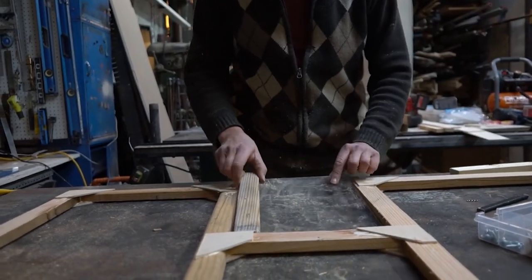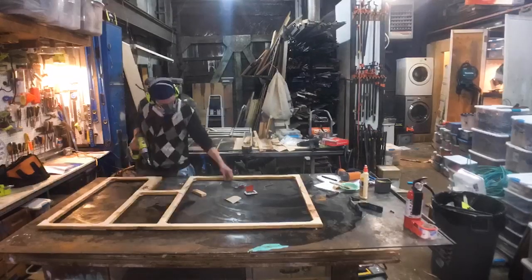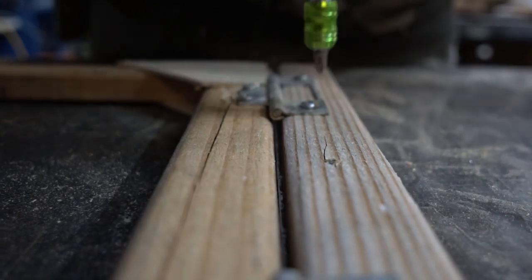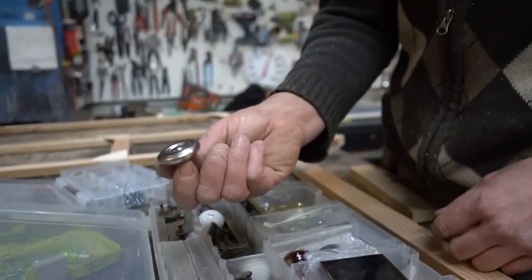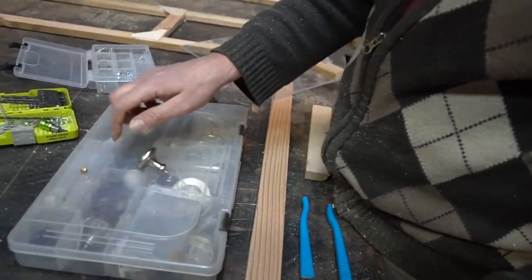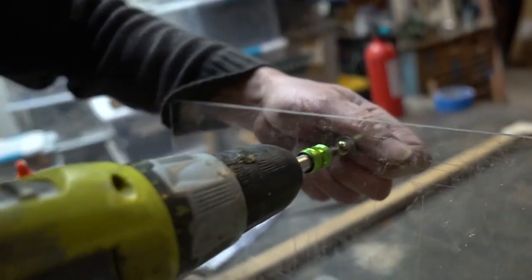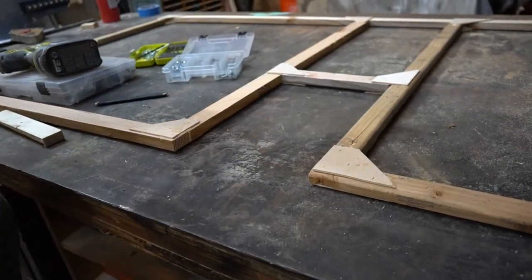Flip it over and get your hinges. When installing your hinges, the hinge pin, the round part of the hinge, should be facing up, and it's your spacer. It's the space between the piece of wood you just screwed to the plastic and the frame. The bolts that come with drawer pulls are not intended for such thin material, so you can buy number 8-32 half-inch bolts and washers, or cut the bolt that it comes with. Attach the knob and check the door. Then remove the door from the frame, keeping the hinges on it, and put it in your kit for installation.